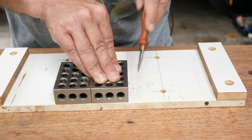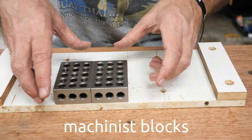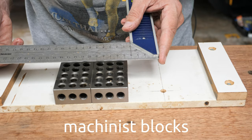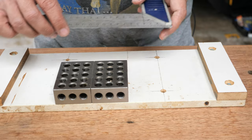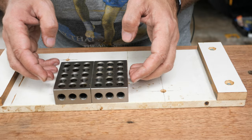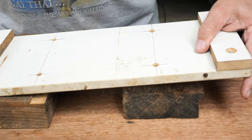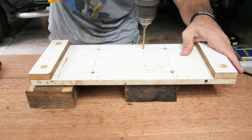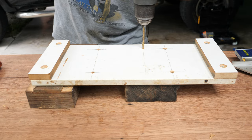I really find these machinist blocks very useful. When you measure by hand you will always be off by 0.2 or 0.3 mm — it just doesn't do the job. The metal block, when you position it precisely, is guaranteed accurate. I can feel that the bit registered on the cross of the scored lines.